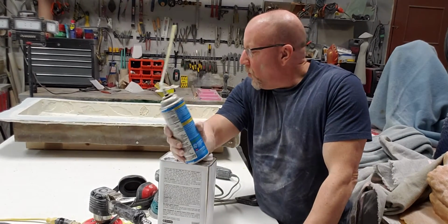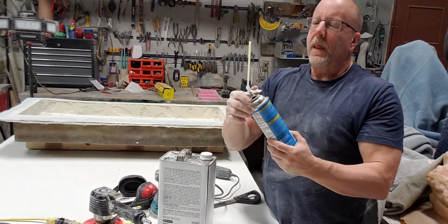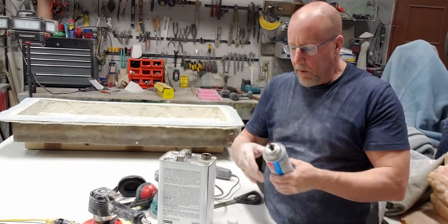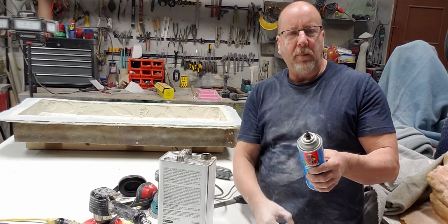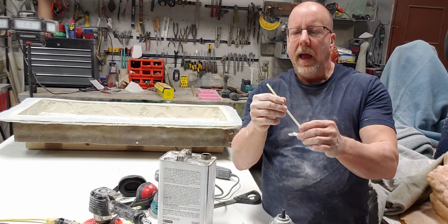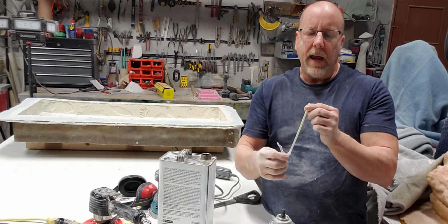If you're making your foam plugs or you're spraying the insulation inside, you don't have to. You can actually fill it with anything you want as long as you can get glass on the top. But somebody said to me once, aren't you wasting so much of your foam? So what you do, as soon as you've sprayed, just take a cap full of acetone and put a little bit down the top spout of the spray foam, and then take off the directional thing for spraying the nozzle, and up here do the same. Just pour a few drops of acetone in the top, get your air hose, give it a quick spray, and it's good to go. You're good to use.